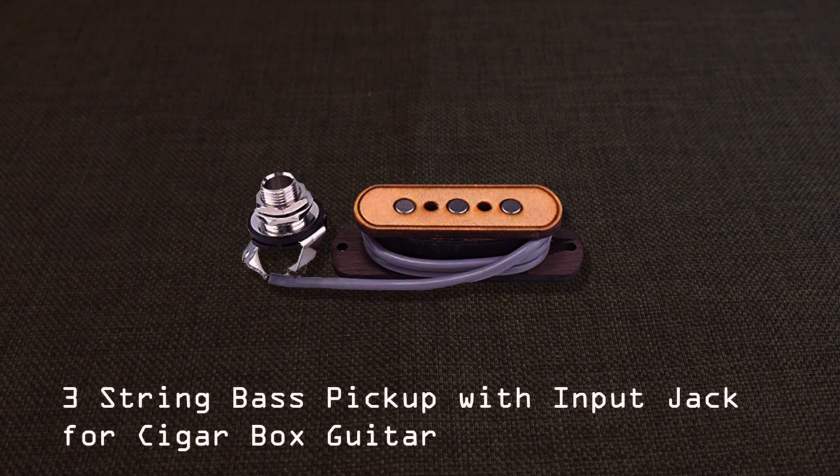Another option is a three-string bass pickup with an input jack for a cigar box guitar. These are fairly cheap — around about six dollars — and very simple to install: just make a hole underneath the soundboard under the three strings. This is for the short guitar neck, and the pickup will pick up the vibrating strings so you can put it straight into your PC. Funny enough, they're also on the apprehension engine version 2 that Tony Duggan Smith has created. However, if you don't want to go the hot rails humbucker route you can go this version, or you can even put both on there for more options to get sound from your apprehension engine into the computer.